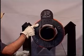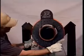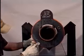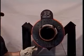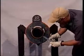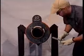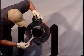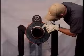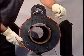Machine is adjusted to center using opposite legs to move back and forth. Machine should be squared and centered using opposite legs. For more in-depth details, please refer to the operations manual. For our demonstration, we will be squaring and centering the machine without the tool slide since we do not have a critical cut line. For field application, the machine should be centered and squared to the cut line.